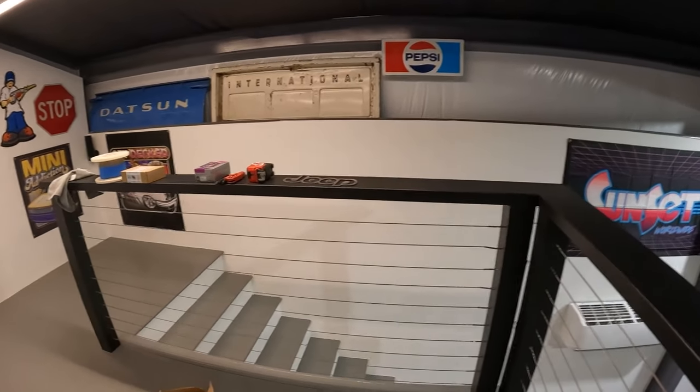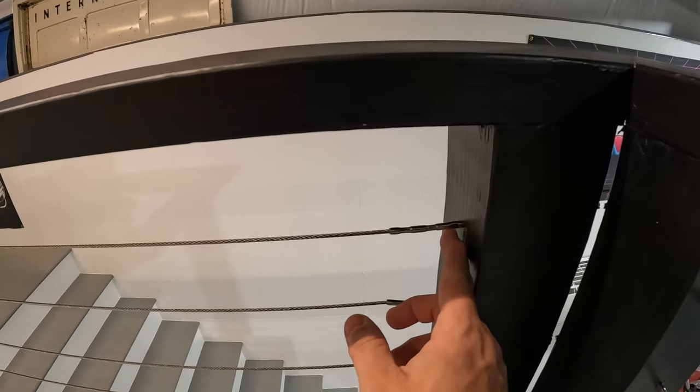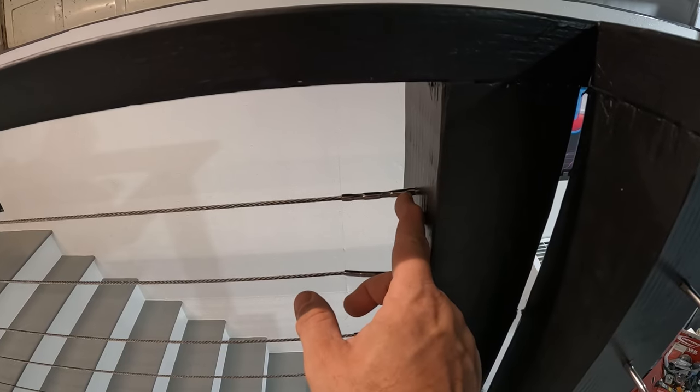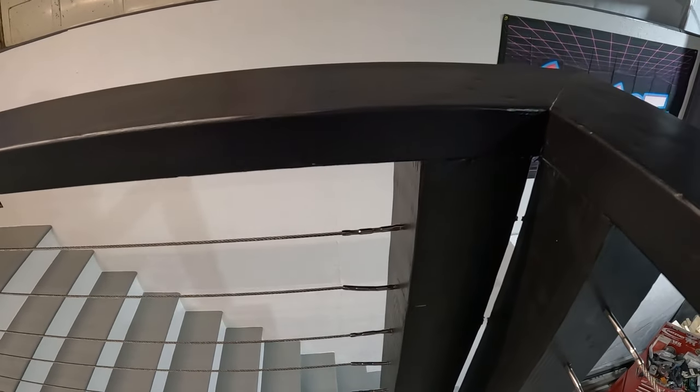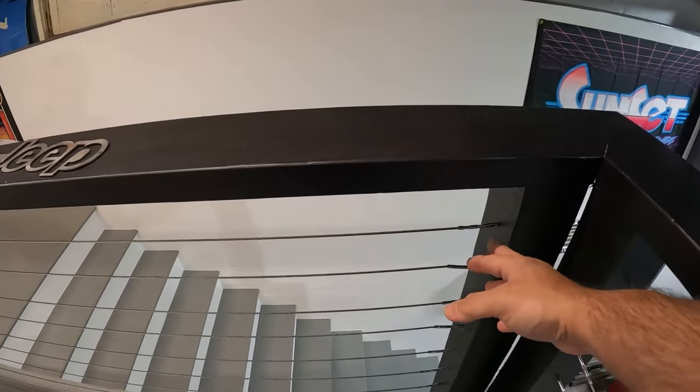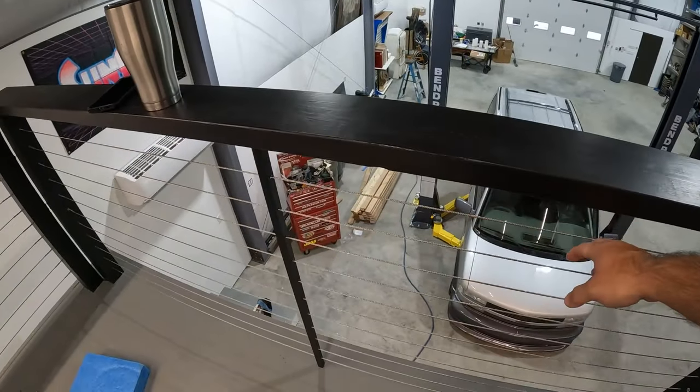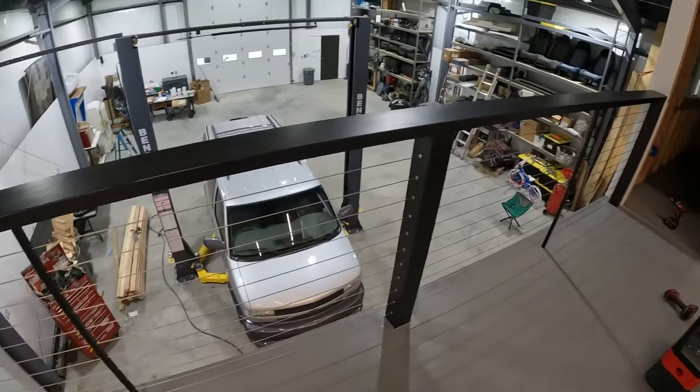The turnbuckles, right as you got to the little adjuster, or the flat on the turnbuckle that you can tighten it with the spanner, it was bottoming out against the post. Worked perfect. On this longer run across the front, I did the exact same thing, 1.8 inches shorter, because it worked great on the other side. Why wouldn't it work on this side?